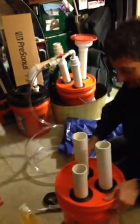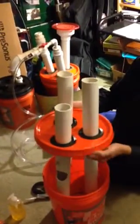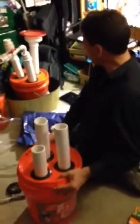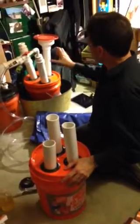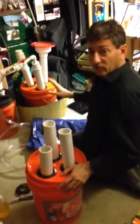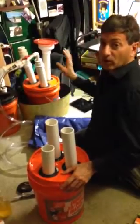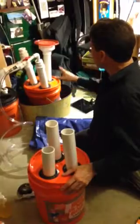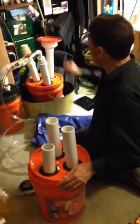These paint buckets are very flexible — that's the problem with them, they're not ideal. The IBC tanks are a lot better, but this makes a nice school and home demonstration for an active biodigester. You would feed this about a cup of food waste a day, but once it starts producing biogas — don't feed it before that. Start with inoculant, either from a working biodigester or put in some animal manures and let them sit for a couple of weeks. Once it makes flammable gas — because it'll first be CO2 — then you can start feeding about a cup a day.